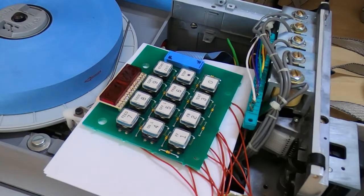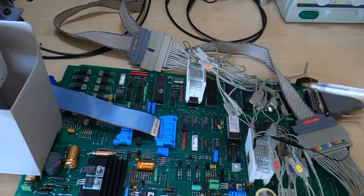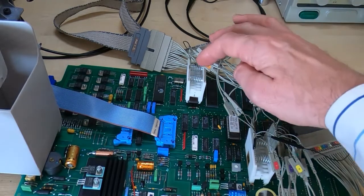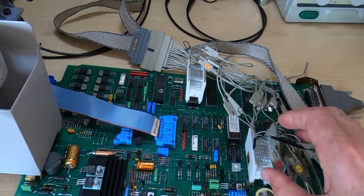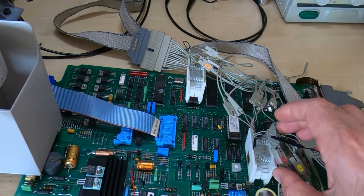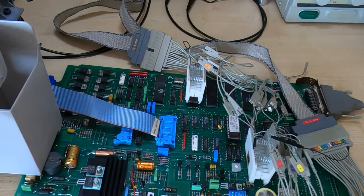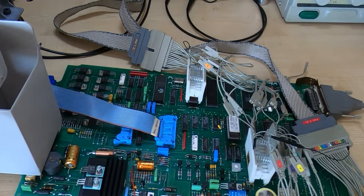So I decided to take a different approach. I'll reposition the camera to show where I ended up at the end of the last video. What I've been doing is reverse engineering the firmware - I've been hooking this to the logic analyzer, connecting up the main processor and the external SRAM chip. This is the SRAM that holds the non-volatile data. I assumed that the non-volatile settings including the passcode would be stored in this chip. I'd already tried removing the battery to let it lose its contents, but it just came back with the same settings, so I'm assuming there's a mechanism within the firmware for putting in place the default passcode. I decided to try trapping various locations within the external SRAM to see if I could find what the passcode might be.